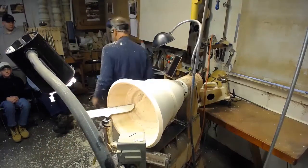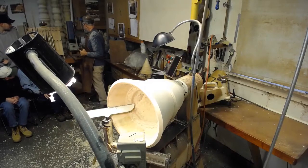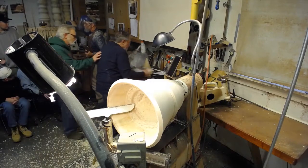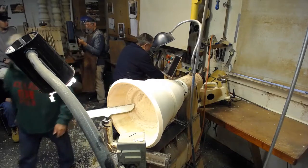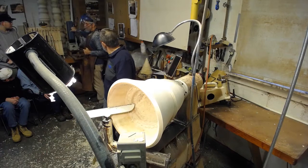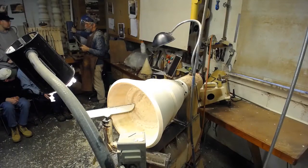I'm going to talk about sharpening. So John Siegel's system is brilliant, unconventional, and it's all based on this inexpensive 4x36 belt sander, right? If you're using a lot of fancy metal, these are pretty high-tech gouges, you may want to get zirconium oxide belts, but if you're using regular high-speed steel, you can do it with aluminum oxide belts, which is what you do, I think.